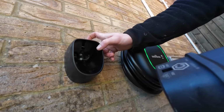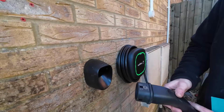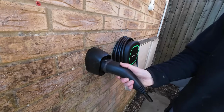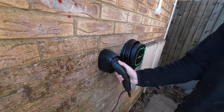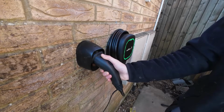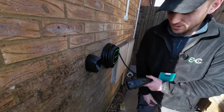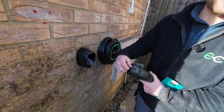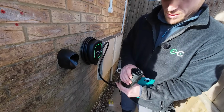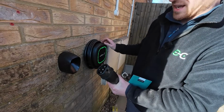That is because most users don't know it actually has an inverted hook inside it. So what most people tend to do, when they want to take it out, is just yank it. As you can see, it's stuck in there, and a lot of people tend to just rip it out. It breaks the hook, and then the cable holder's pretty pointless after that, and you just have to use this rubber seal to make sure no condensation or anything like that gets inside the plug.